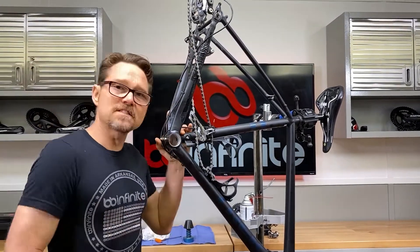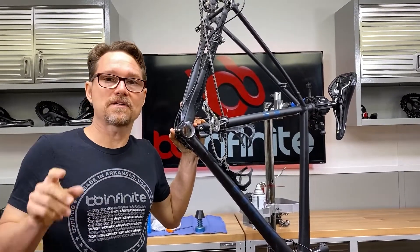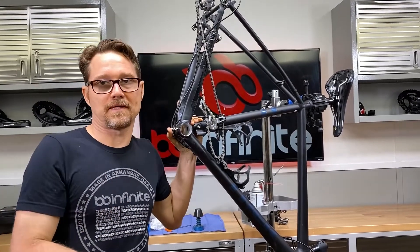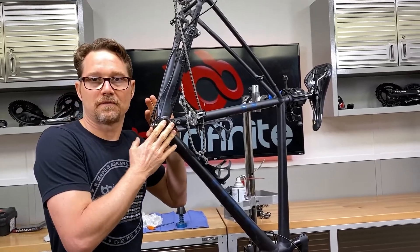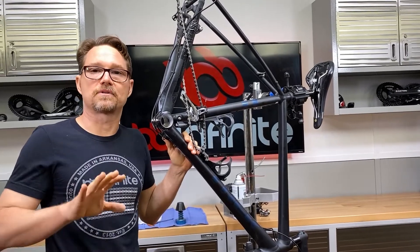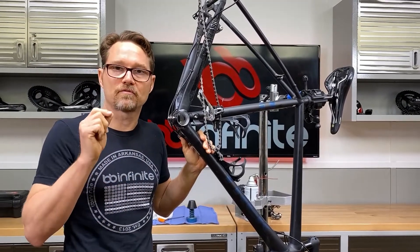This hole is about five thousandths of an inch too small — that is a lot. That is normally the amount you would leave on if you intended to ream it. So what very likely happened is this bike missed getting reamed and ended up in a box. This can happen — factories are a generally orderly place, but things like that can slip through. You have to be on the watch for this sort of thing.